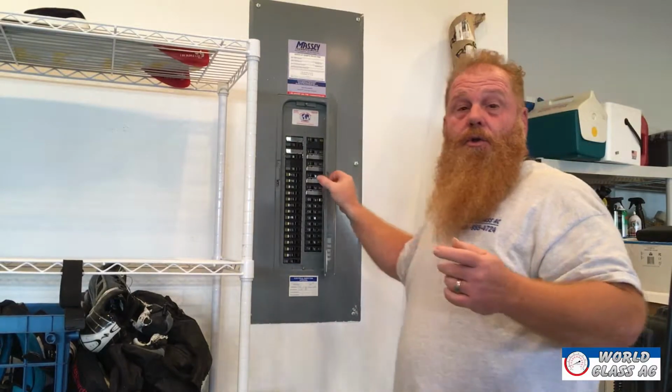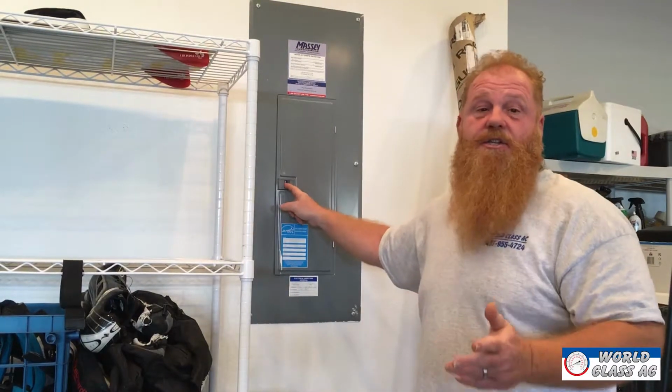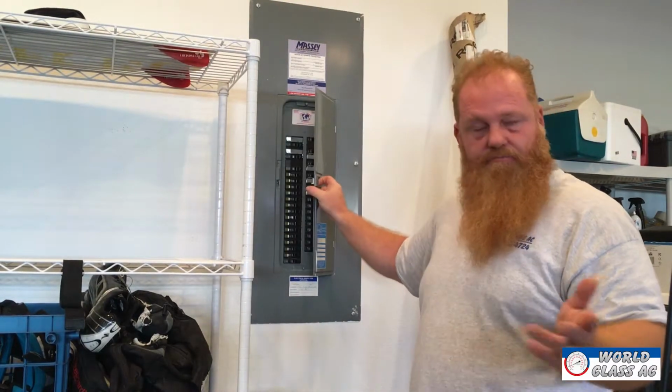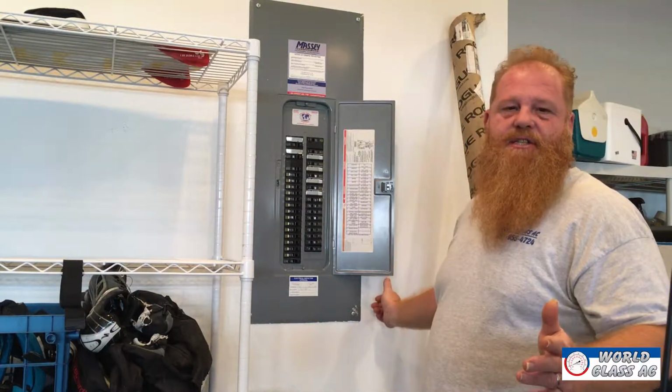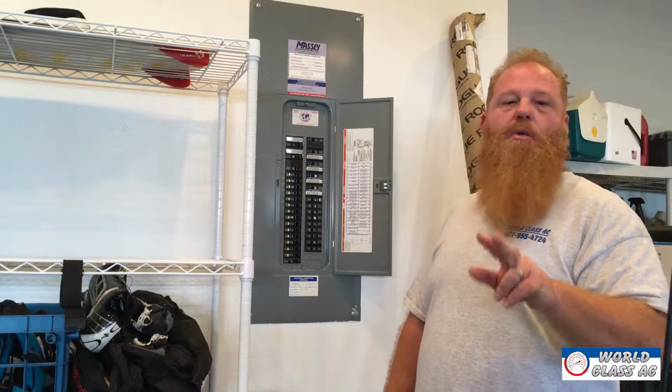All right, so before you call, there's some things you ought to check on your air conditioning. The first thing, as most of us know, is we're gonna walk out here to the electrical panel. In most air conditioning systems in Florida, you're gonna have two breakers. You're gonna wanna locate them.